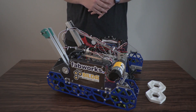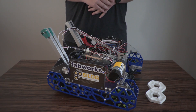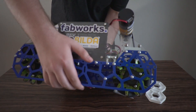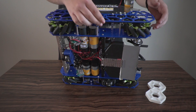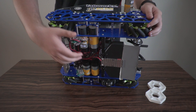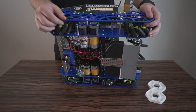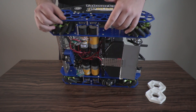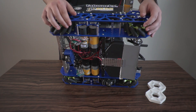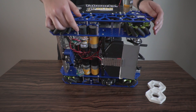The first thing we want to talk about is our drivetrain. We're using eighth-inch 6061 aluminum with parts cut and provided by FabWorks. Something interesting about this design is we are doing sunk drivetrain motors, which allows modularity and leaves empty space in the middle for attachments or to shrink the drive base. We're also using a belt drive where we increased the center distance by 0.3 millimeters in CAD, which gives an excellent belt stretch — perfectly tensioned with no tensioners required.